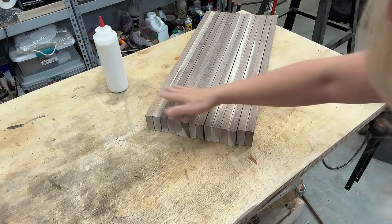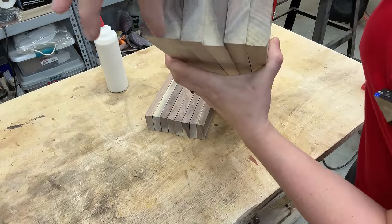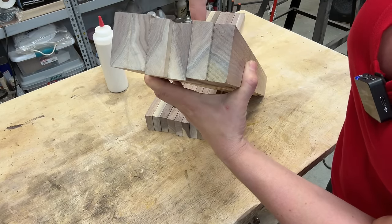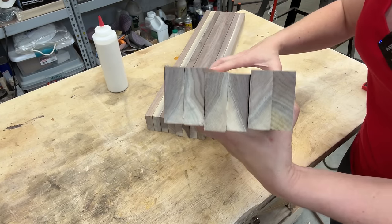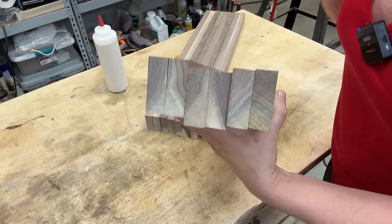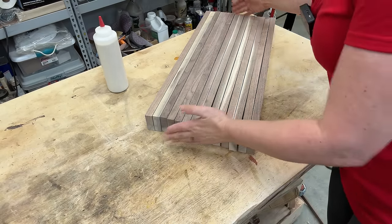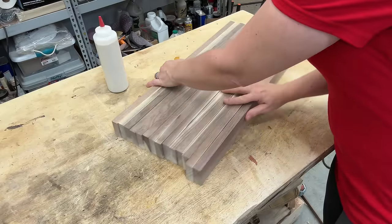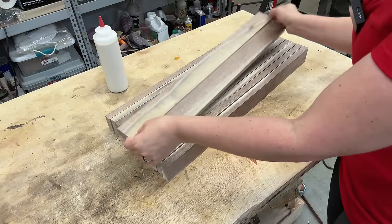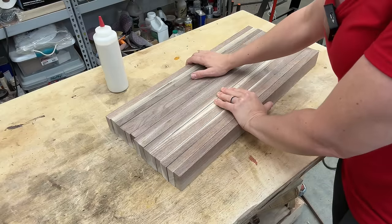When I look at the side view, most of my sap is on the bottom, so all boards are oriented the same way. Because if one has sap on the bottom but the next has it on top, the back and front will be mixed and not look beautiful. My boards will have a definitive top and bottom because I'll be putting a heavy chamfer, so you can't really use it on both sides. I'm going to glue them like this — flat face to flat face — which will make the glue-up a lot faster and easier.